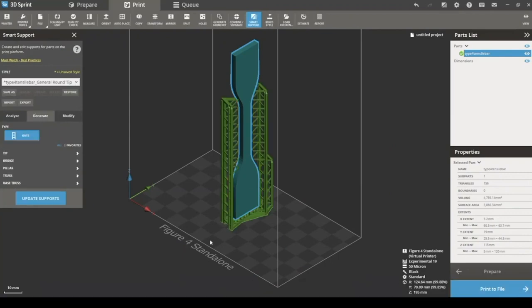And something to think about with a type 4 tensile bar is what you're after here. The application is I want a good, clean tensile bar that I can test and put into the grips of my machine, and I want reliability. I'm really not that worried that I've got the best flat bottom surface. I just want to print a half a dozen of these and then go out and see that I can test them.